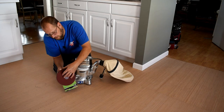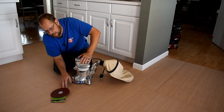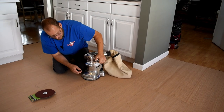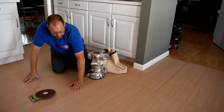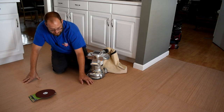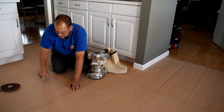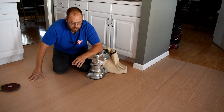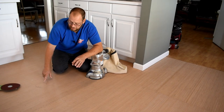I use a 50 grit for this and these are really strong — these are actually fiber pads instead of the paper pads that you get, so I like to use those. I'm just going to run over these seams really fast; they're almost perfect like they are. However, I can feel just a tiny lip here and there, so I do want to run over all of my seams. Any staples that failed to get completely countersunk in the underlayment as I was stapling it down, I did circle.